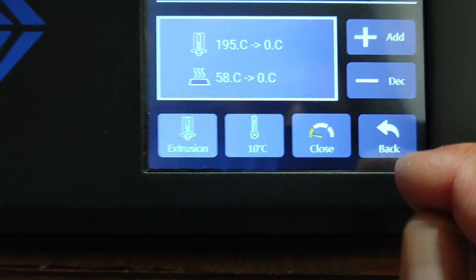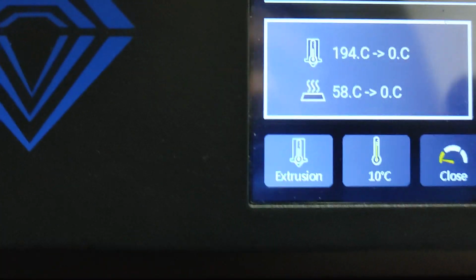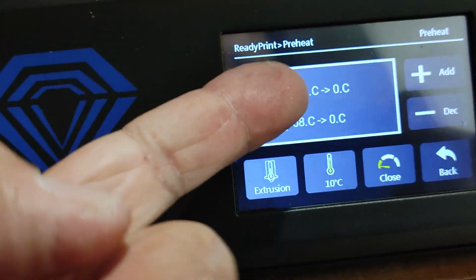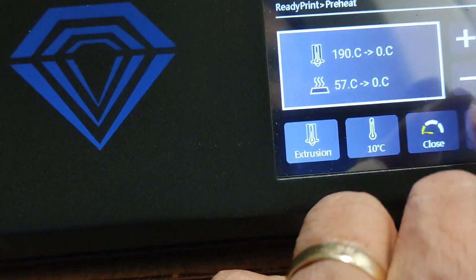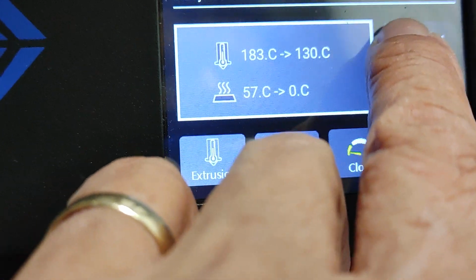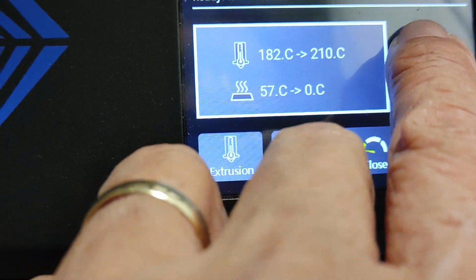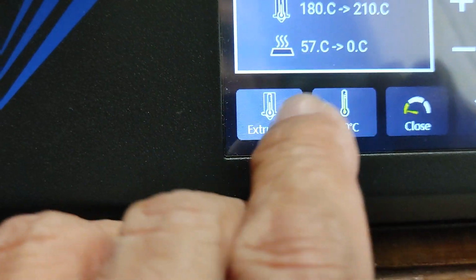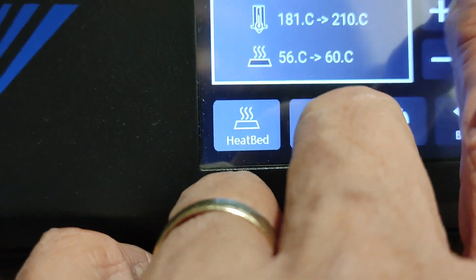Yeah, something's not right here. I don't think it should work this way. You shouldn't have to preheat the machine. Those values should come direct from the file. So if I hit file print, it'll start printing at that temperature, and it won't extrude. So I have to raise these temperature settings back again to 210. Table back to 60. Say OK.